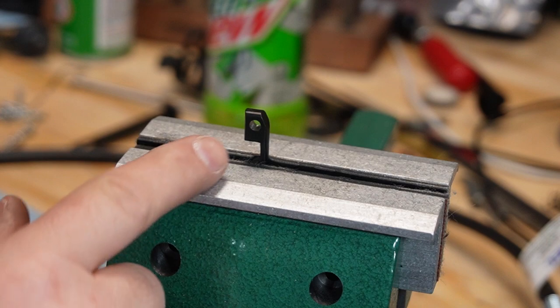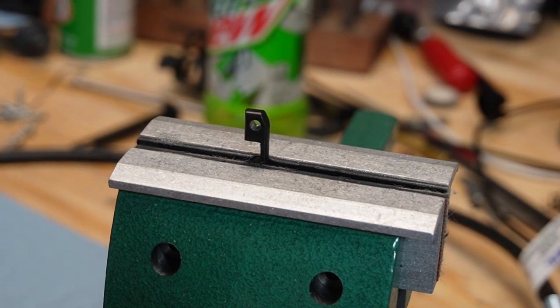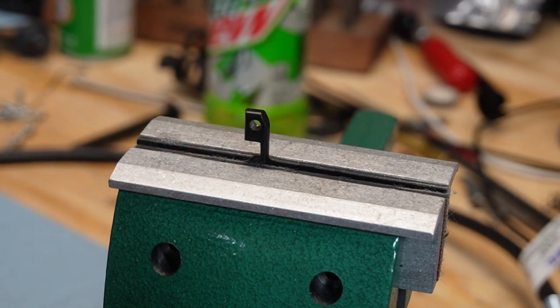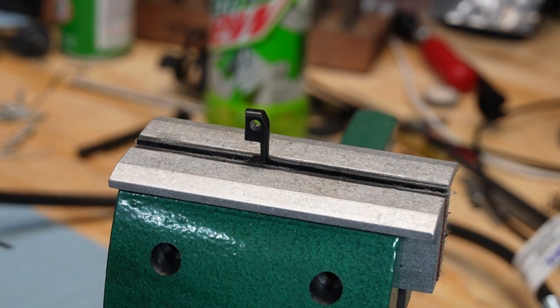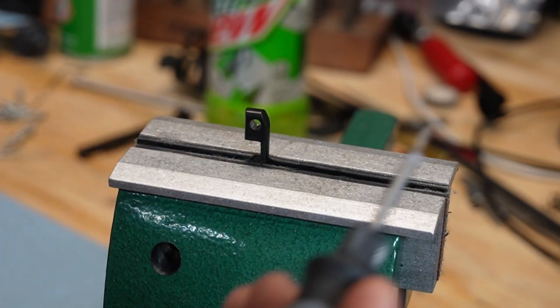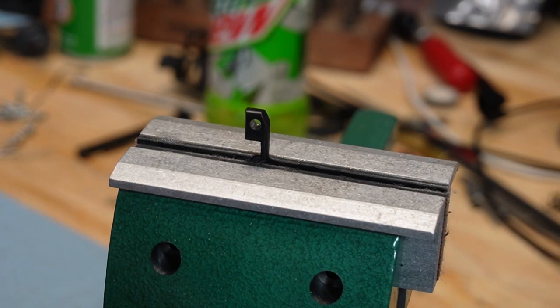My concern when I was drilling this out — I was going to put a second hole in right next to it — but the space is so limited, and my second small pilot hole was pretty close to the main hole that I had just put in, and it just deflected enough and it won't grab. So what I'm going to have to do is take my Dremel with a carbide bit and just remove the material that way. I'm sure we'll speed it up so you don't have to watch or listen to this.